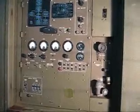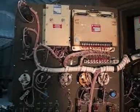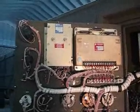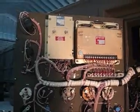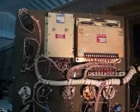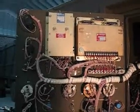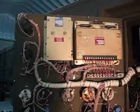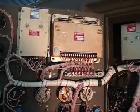Let's take a look inside the Hunting HiVolt control panel. Here you see the back of the main control panel — the back of the meters and switches. The small unit in the middle left is the speed controller. The engine has a magnetic sensor which looks at the teeth on the flywheel. Each tooth that passes the sensor sends back a pulse and those pulses are counted in this box and divided so that the speed can be controlled to either 50 or 60 hertz.